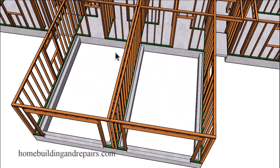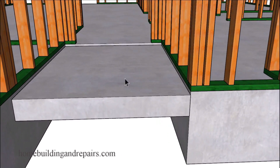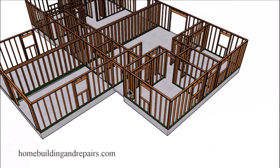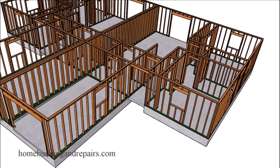The garage slab is going to be separate from the foundation along with the porch slab, and we will have a one inch step down. Both the porch and the garage slab will slope a minimum of an eighth of an inch — probably a quarter of an inch per foot is going to be better. You might not need that because both of these areas are going to be covered by a roof, but I don't think you'd want to make it level.